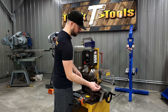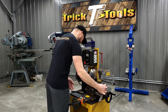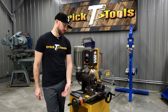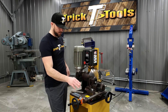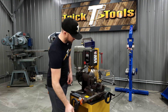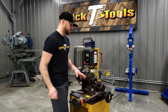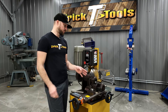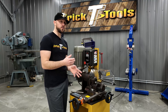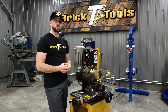Once that's loose, you can move the vise in either direction to get set up for your notch angle. Once you get it set, return the handle back, bump it tight, and it's nice and snug. There are two levers on here — one moves the vise in and out, and the other moves it side to side. That way you're not constantly notching on the same spot. You can move it back and forth depending on your angle to make sure you have it properly set to the end mill and your material.